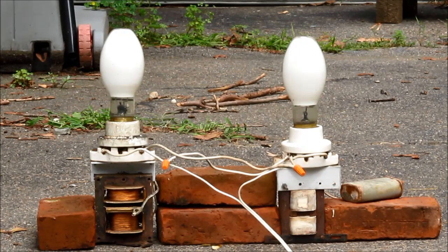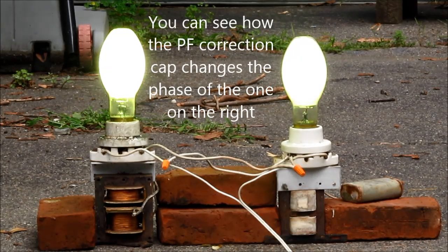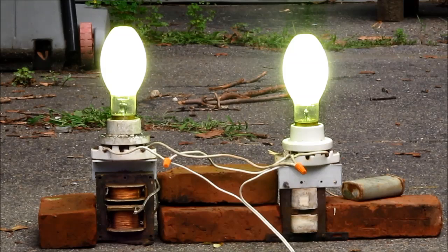Since it's been going for about five minutes and no magic smoke has come out, I'm going to de-energize and grab my thermometer to see if anything got hot. Since no part of the older ballast was hot or unusually hot, I'm going to connect them both up together and have a bit of a warm-up race and light output comparison. It's been a little over five and a half minutes. The ballast and lamp on the left seem to warm up slightly faster than the one on the right with the older capacitor ballast. However, both have stabilized and appear to be at about the same brightness, and the lamps both appear to be in about the same shape.